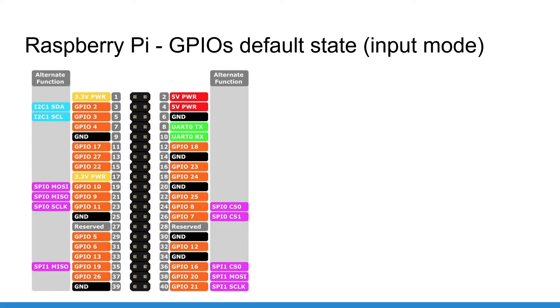So what is the default GPIO state when you put them in input mode? For GPIOs numbered from 0 to 8, the default state will be high. When you read the pin just after you boot, you will get high, which corresponds to a voltage of 3.3 volts. For example, GPIO 2 — by default, you know it's going to be high.